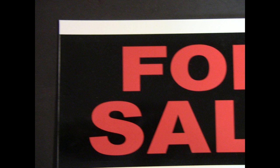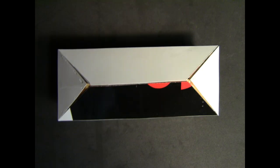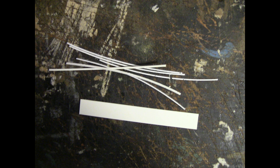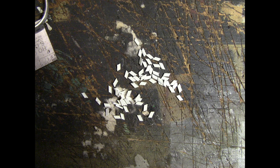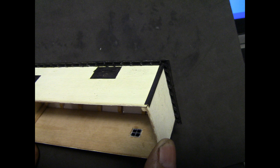I go find my for-sale sign — the cheap plastic I always use for stuff like this. There's plenty of support so I'm not adding anything extra. I turn the building upside down on the plastic, draw out the lines to make sure there's a one-foot overlap sticking out at the bottom of the wall, and cut the pieces and glue them on. The two ends I have to play with to make sure everything meets right at the bottom. These all have rafters that stick out on that one foot, so I cut some lengths and came back and cut all my one-foot rafters. I cut these so I could put a fascia board on, then realized the drawing shows this building doesn't have one, but that's okay. I marked them two feet on center, glued them into place, put black paint on all that, and that's the whole underside of the roof done.